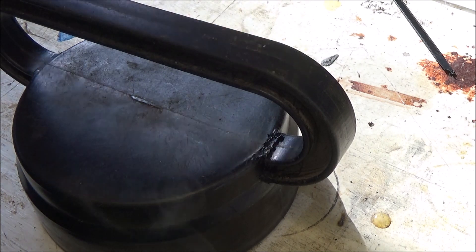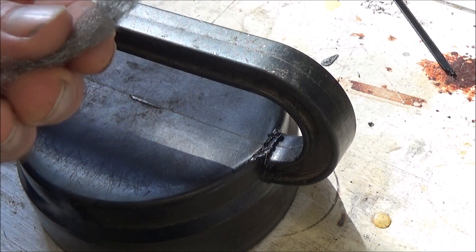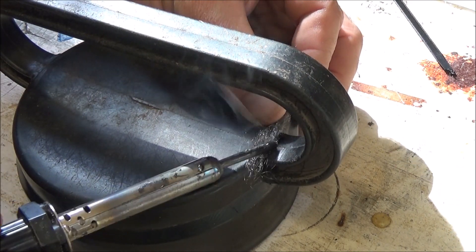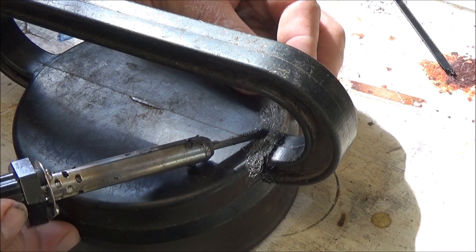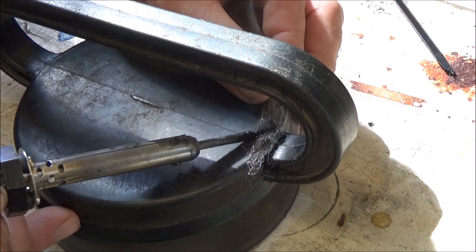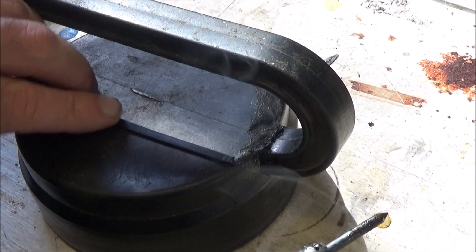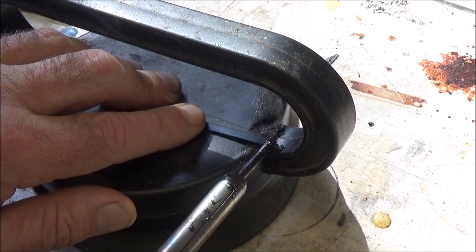Here's another couple of things you can do. You can take some steel wool — not a Brillo pad because it has soap on it, just get some regular steel wool, the finer the better. Put that right in there and tack it in. This is going to act as a little bit of a fiberglass-type effect. The metal really conducts the heat very quickly. I'm going to tack it down right into the plastic, then come this way with my plastic filler rod to basically sandwich that metal right in there.